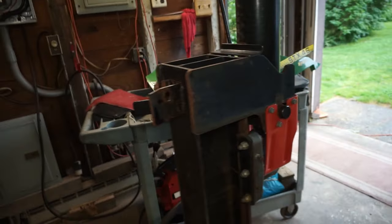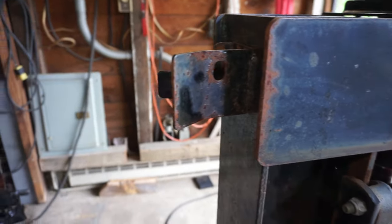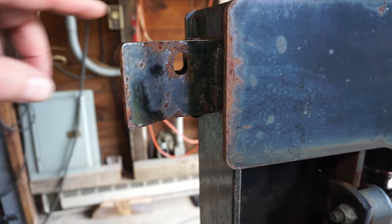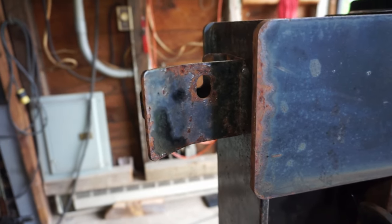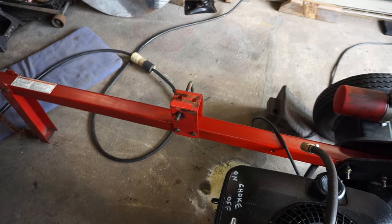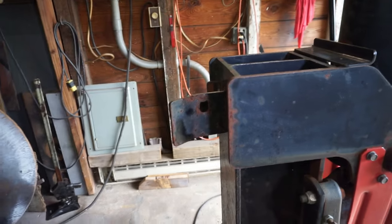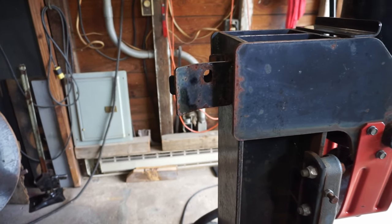It's getting there but it's a little dark in here - I've got to replace the lights. That engages with that pin. I've got a nice big thick heavy washer. She's a little bit wallered out. I'm going to grab my grinder and wire wheel - we want to make this area real clean for a weld. I'll do the same thing to the washer, might have to put a little flat on the washer. Then we'll drop it down, put the washer on, tack it, bring it back up, finish welding it, then paint it and make it nice. All right, nice and clean with the grinder.